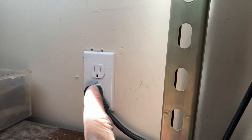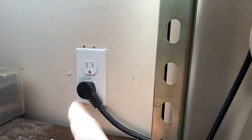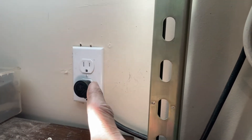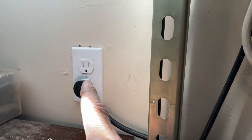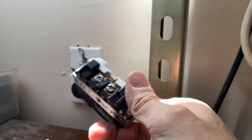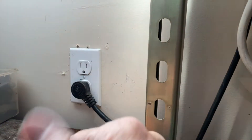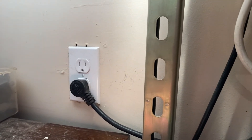So this plug here goes to a power outlet that has six outlets or something. I had a bunch of stuff plugged in, everything shut off and I didn't know why. When I tested this plug I had 94 volts. It didn't look bad, and when I tested the plugs that were tied to it they were 94, 94, and then I had one more plug that was 120.